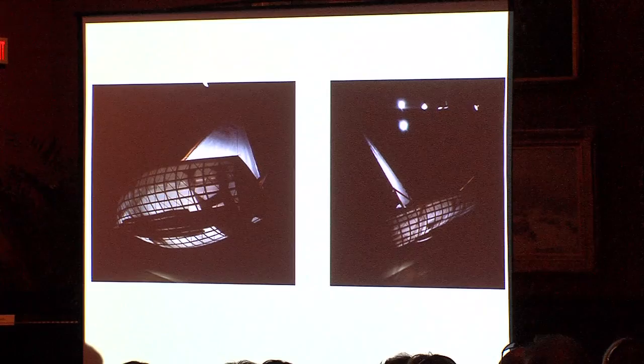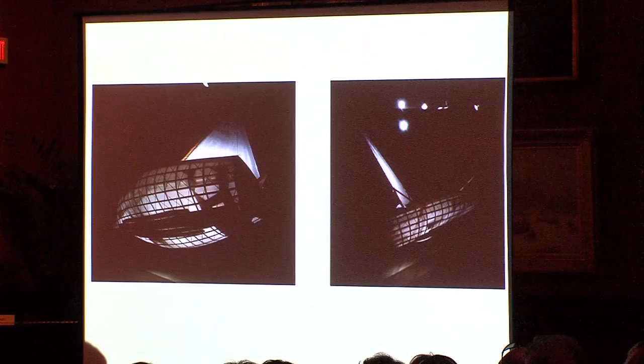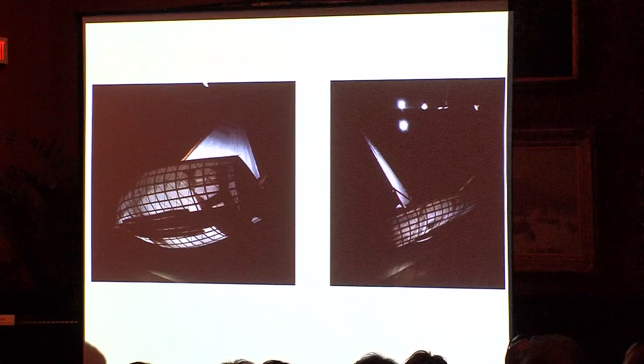The wood frame is steam bent white oak and fir, and then it's got a skin on it. That's fabric. It's called Dacron. It's made by DuPont. There's Kevlar strings that triangulate the whole structure to keep it from twisting. And the sail is made of Tyvek. So all the synthetic materials are all DuPont. The natural materials are wood.